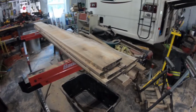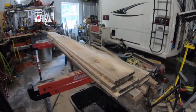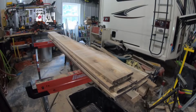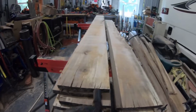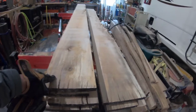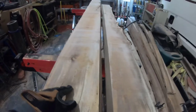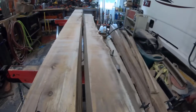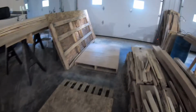Okay, so in the barn where it's probably 20 degrees cooler than it is outside, here are our 9 boards that we got off the mill today from that smooth bark hickory. I'm real happy with them. They're not wavy. They're the same thickness from one end to the other, and they're going to be just perfect for our use. So I've got them stacked so that the smiley face is up, which means that I've got the face that I want exposed setting up on all of these, because what we'll do is we'll edge these two on the table saw right there, and then we're going to run all of them, the face that we want, out through the planer a couple times just to smooth it off as smooth as we can. And then we'll come over here and sticker them, stack them, clamp them, and get this fan turned on. And they'll be sitting here for about the next 2 months while they dry up.